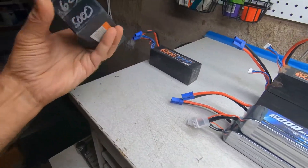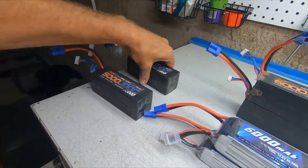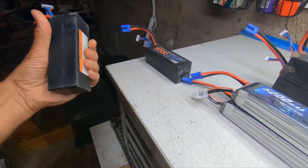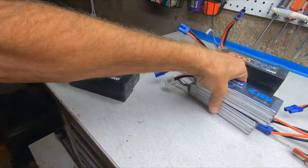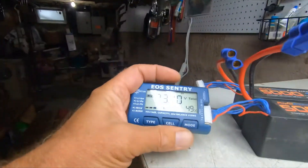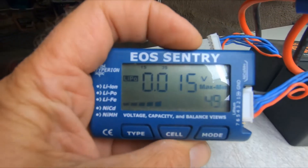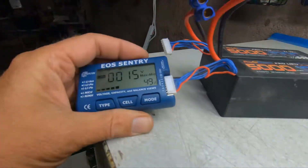I don't know if they're worth it. The only problems I have are these 6S cells - they puffed like day two. They've got a little puff to them now, but after you run them they get hot and puff up, and when they cool down they swell. They're not square like they were. Let me plug one in - there's not a lot of difference between the cells. 0.015 - that's pretty good for six cells.